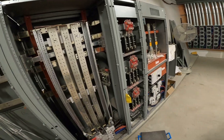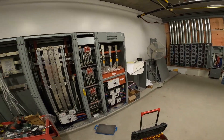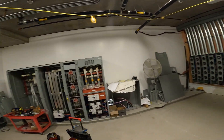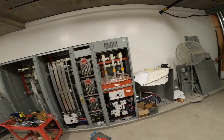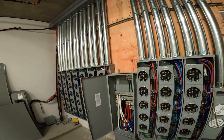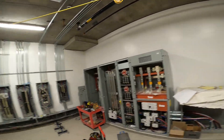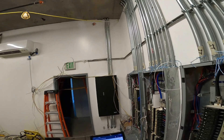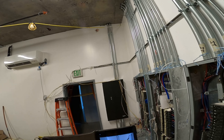I'm an electrician — you're supposed to understand this stuff — but I'm not going to lie, they came in, we had a big meeting, and that's what they're going to do. They're going to abandon those runs. That breaker feeds this bus — a meter section 2000-amp breaker. We're going to abandon everything going down the bottom. That was a full day, three guys pulling those runs of 600s — gone. Going to be four runs. I thought they said 750s, now they're saying 600s again. Anyway, we finally got our lighting control panel but we haven't done anything with it — just sitting there.